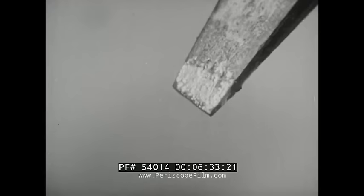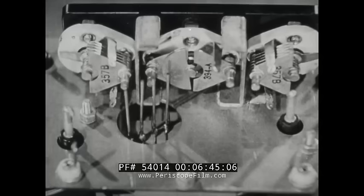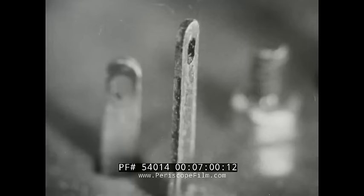Notice that this wire terminal and wire are already tinned. Pre-tinned copper wire is used in most electrical circuit assemblies. The terminals or lugs are also tinned before assembly. However, these terminals should be carefully checked to see that none are dirty or corroded. If any seem dark or dull, clean them with a bit of sandpaper.